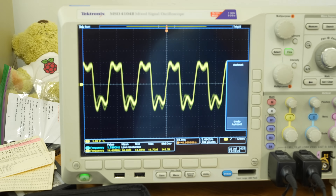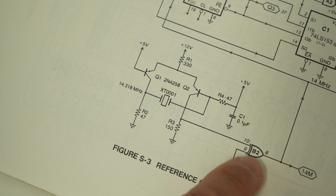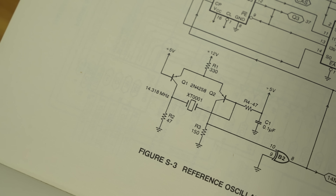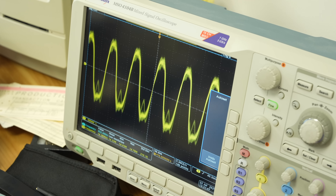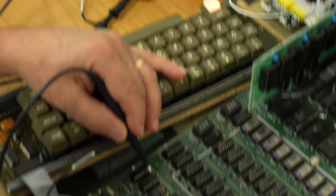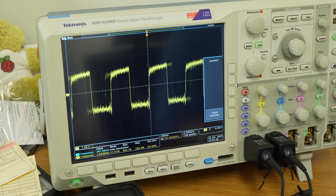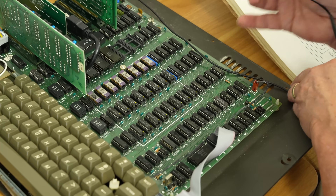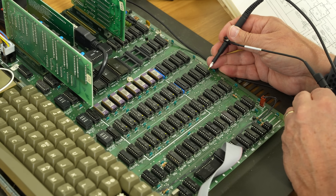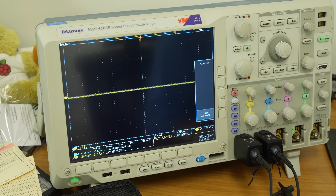After checking all the chips, I wondered if maybe the clock was bad. We got out the oscilloscope and opened the red book. There's a 14-megahertz master clock in the back corner, and it distributes out, splitting at different chips — down to seven, three, and all the way to one megahertz. The memory runs off the one. You can go to the pins and check whether you're seeing the clock coming in at the right frequency. We did see that, though the waveforms weren't square — more like mountain range waves — which could be probe adjustment, but it was a little noisier than expected.